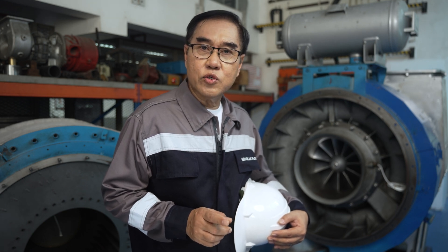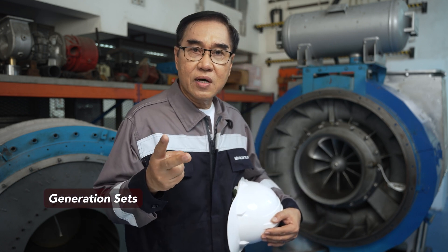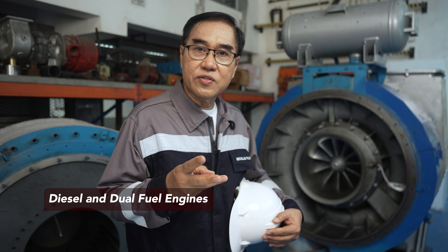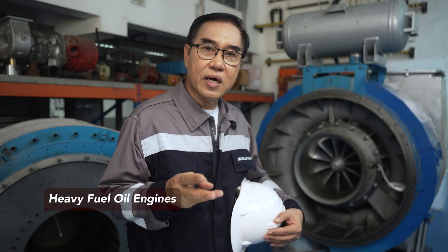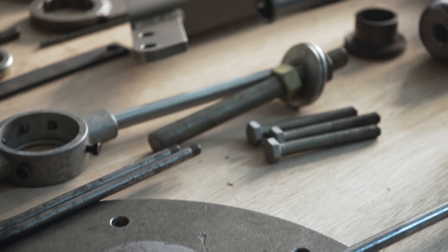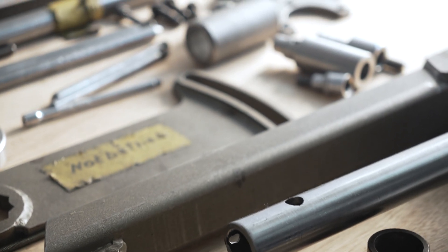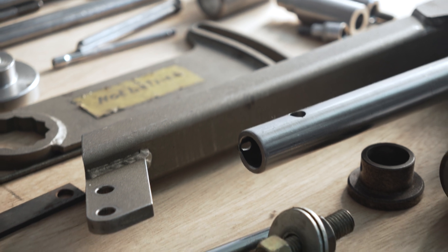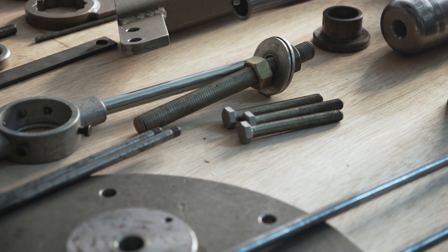Aside from that, we can use turbochargers in various applications of propulsion units, generating sets, diesel and dual fuel engines such as liquefied natural gas and methanol engines, and lastly heavy fuel oil engines. Nowadays, different turbocharger makers use plain bearings, which MAN uses, rather than ball bearings or roller bearing double rows, for more advantages.